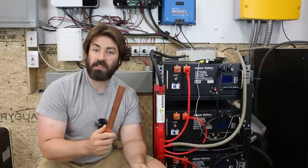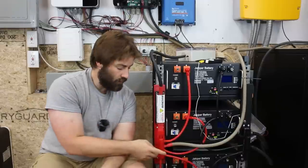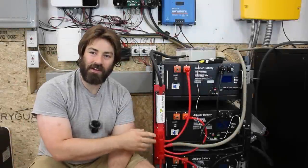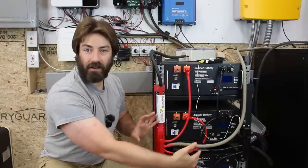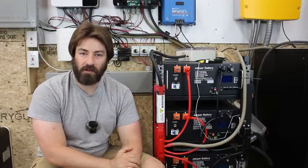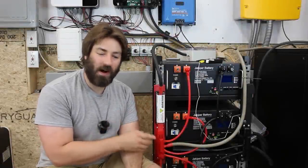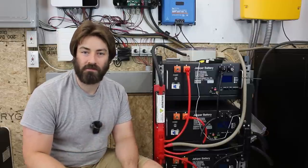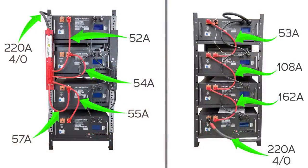The solid bar would actually be less expensive than buying the pre-made cables and the central bus bar. But in my opinion, having a central bus bar with wires running to it from each battery and a fuse for each stack of batteries is probably best practice. Hopefully I've demonstrated why I believe that in this video. I really hope this video shines some light on why I'm such a big fan of central bus bars and how they can really benefit your system. Just make sure you size it correctly for the amps you might potentially be moving through it.